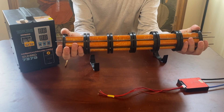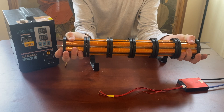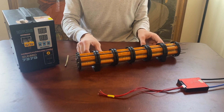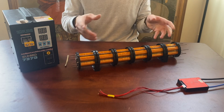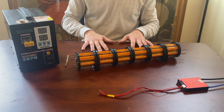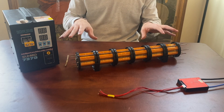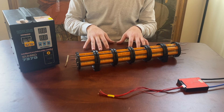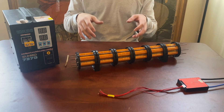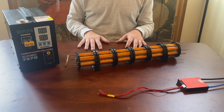The whole battery is very strong — it handles compression and tension very well because of the rods that hold it all together, and torsionally it has very strong rigidity, which is important because aircraft experience a lot of torsion in the fuselage from roll movements induced by the wings. This battery pack is the foundation the whole airplane would be built around. It's definitely a different idea and I think it's a better idea than the way most electric aircraft are built today. I hope you've learned something new — if you're inspired to build a plane like this, please let me know how it goes. Thank you for watching, this is Levi Sheridan, have a nice day.